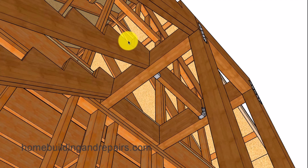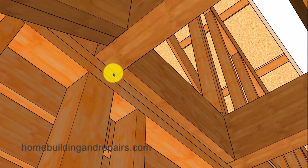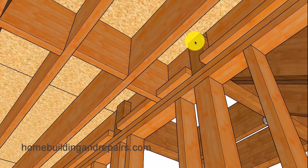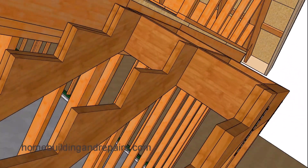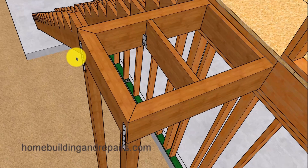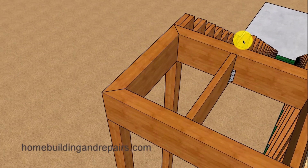For a stairway, a support post might not be necessary because we're really not going to have a lot of weight up there. Here's a version of the beam flush with the wall, providing you with another way to build something like this, along with our double stringers and mitered corners. The double stringers provide a little more structural support and the mitered corners give you another way to finish off this part of the stairway, with the beam sitting on top of the post.